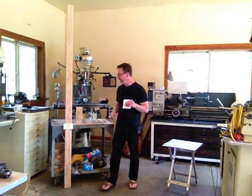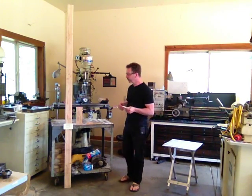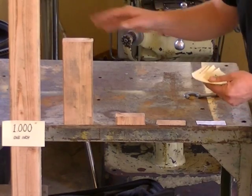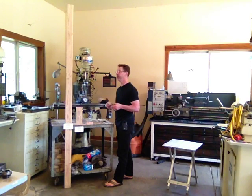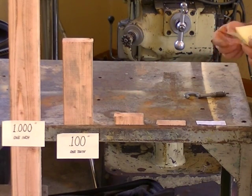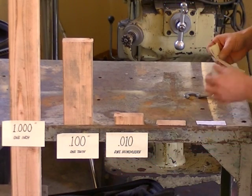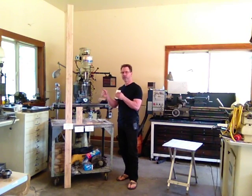It's not something to ignore. He may have only left two zeros — which is fine — then we're only going down to a hundredth of an inch. Looking at our model: this piece represents one-tenth of an inch, and that's .100. If we want to go down to a hundredth of an inch, this block represents that hundredth of an inch — that's .010. I know a lot of this is redundant for some of you, but this is for somebody new getting into machining — I want them to be very clear on the system we work in as machinists.